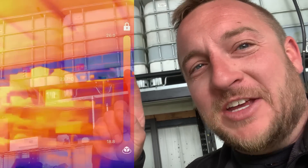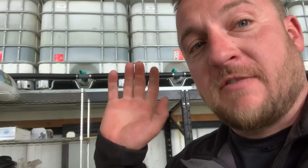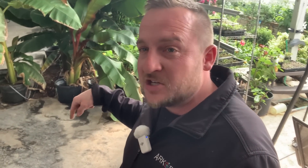In the middle of the afternoon you can clearly see the water is quite a bit colder than the ambient temperature, which means the water is being warmed by the sun by day. Then when I check first thing in the morning or in the middle of the night, it's giving off heat — it's sucking heat right now and giving it back at night. Same with the concrete in the middle of the afternoon: the concrete is the coldest spot. It's picking up all that energy by day, and by tomorrow morning the thermal imager will show the concrete releasing heat. I haven't even utilized my concrete in-floor heat, and just from the ambient temperature the concrete gives off a significant amount of heat.